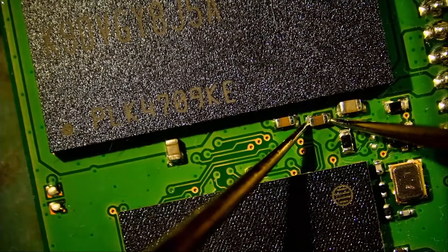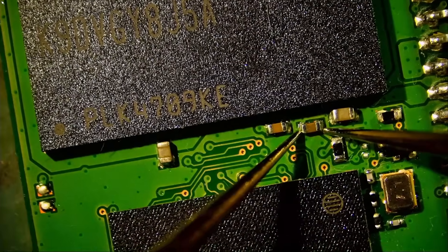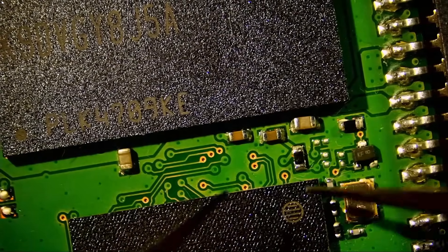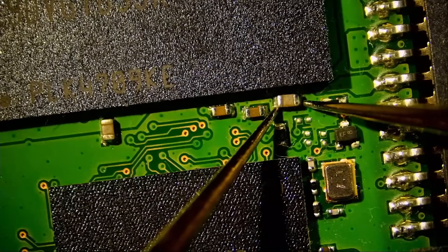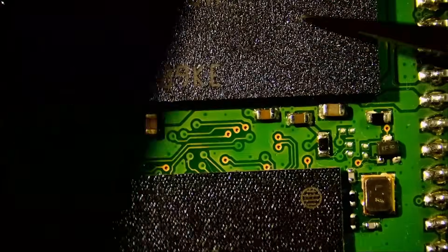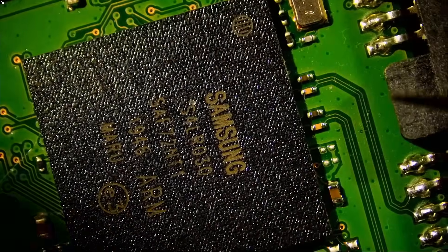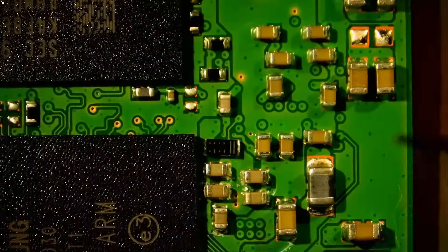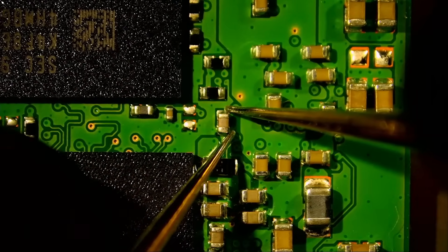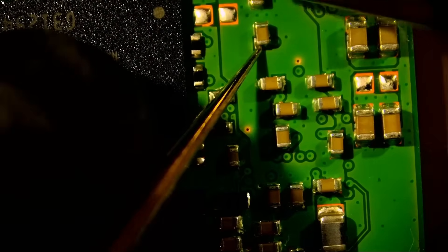I've worked on many crucial SSD drives — well, we had a short circuit right next to the NAND chip, a cap next to the NAND chip. A 0.08 voltage drop reading — that's not a short. So we are going to assume that is okay. Randomly measuring caps near the controller — we do not have a short. We do not have a short.